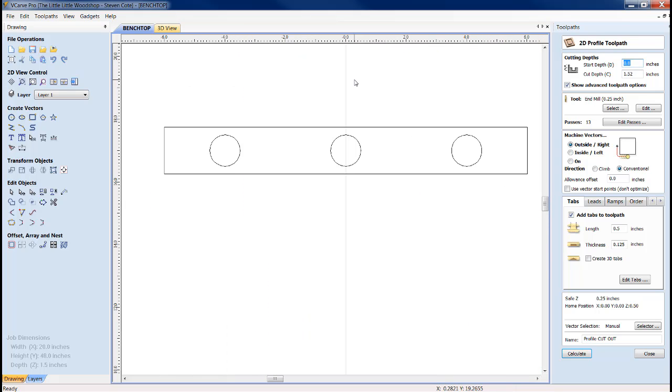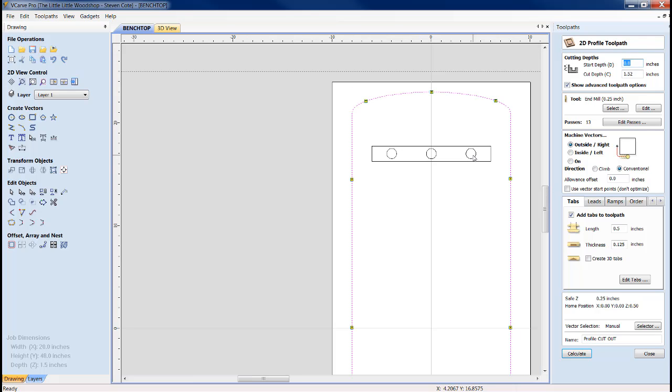The other thing that I told you is if you have screws long enough and you want to go down through the center of these pocketed holes on the surface, it doesn't matter. It's not going to mar anything because you're going to be putting your mounting screws in anyways to screw to the legs on the underside. This helps to give this some rigidity. I did have 4 small screws in the corner. I got the piece of composite on the side here, and I have a stop block across the top, so that when I flip this, everything is technically still straight and square and centered on the machine.